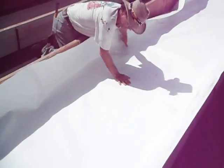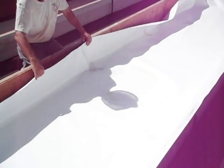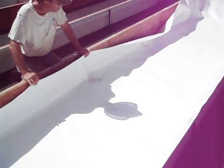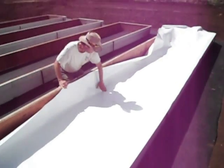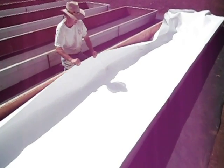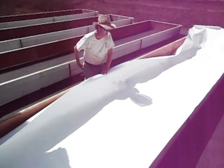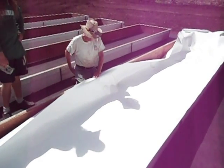It's going to look like this. This middle section, where about six or eight feet, is going to be completely smooth and without wrinkles — usually where it just naturally falls and lies. But that's how you check it. If you see a wrinkle going out from this in either direction, don't staple it down. See if you can pull the wrinkle out.